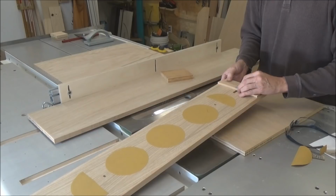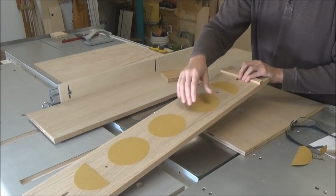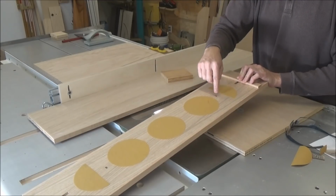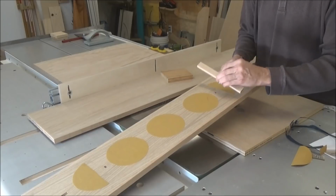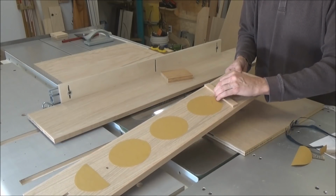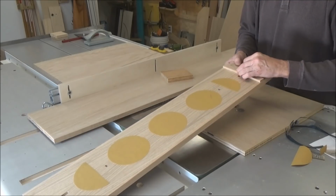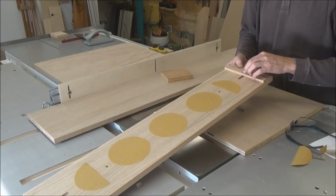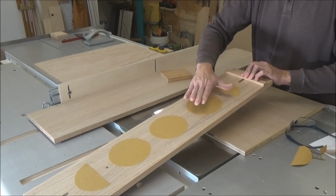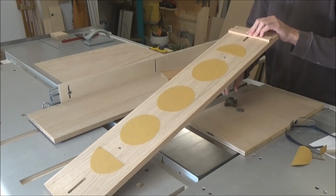So I put that back in here, and then I've got self-adhesive 150 grit sandpaper here, PSA. I've got a hole up here that if I needed to shorten it up, I can bring it up here and use it in a single hole and pivot it and lock it. But here, this is nice because I'll show you why this slot makes it better to use it this way. And then I made it reversible so I could use the other end if I have to.